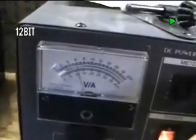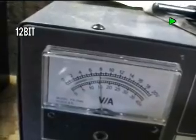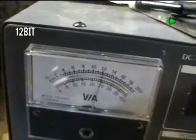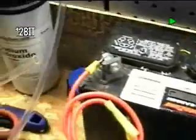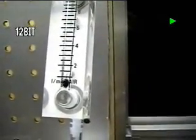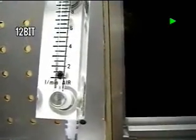Right here, we're going to turn this voltage up from 6 to 8 to 10 to 12 volts. So now we're running at 12 volts, and we're running amperage-wise at just about 9.5 amps. Now let's go back up here and take a look at our air gas flow meter and see what's going on now. With more current and more power being put to the unit, it's oscillating between 0 and 2 quite regularly.